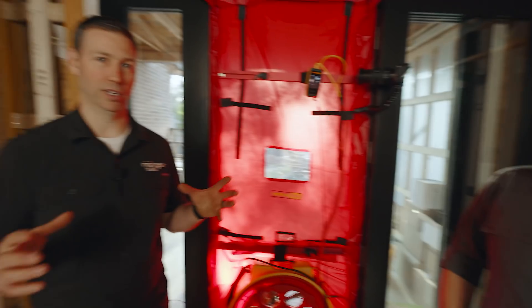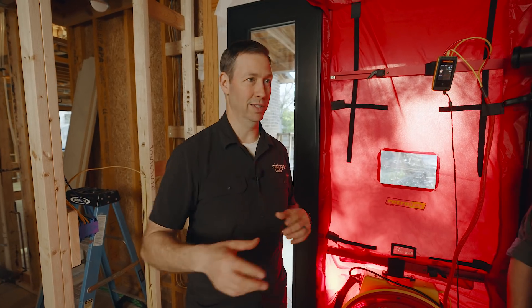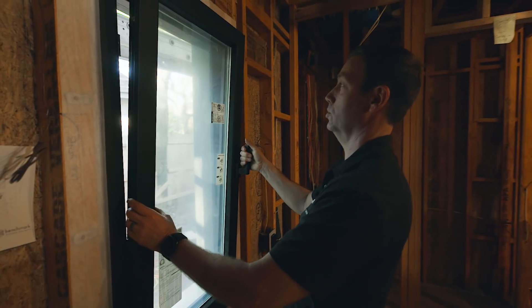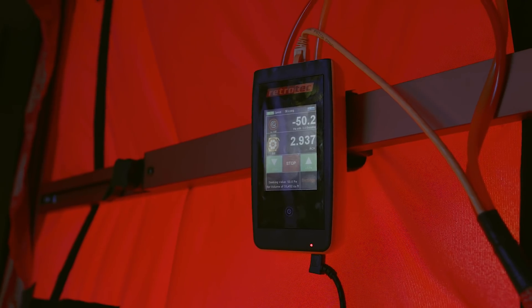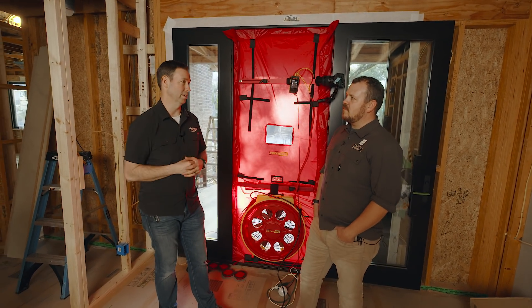The people who say your houses are too tight, you're killing people — no. Even the tightest houses, even code-built houses that have had a blower door test, frankly are pretty darn leaky and could have as much as two windows open. Like this example: we went from 1.67 to 3 by opening a window. So houses are not too tight. Most of the time, houses are too leaky and they need to be tightened.